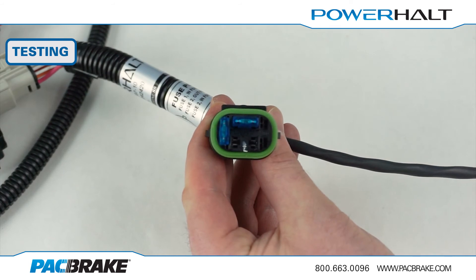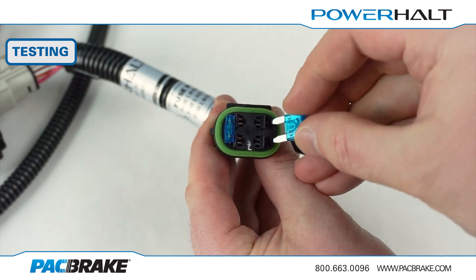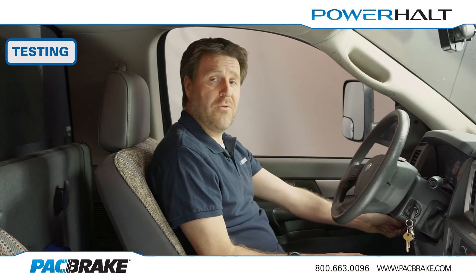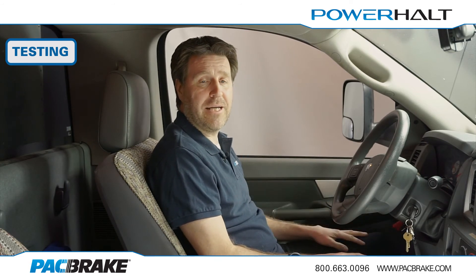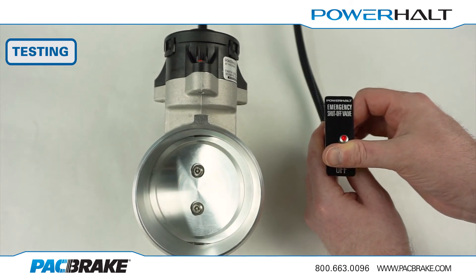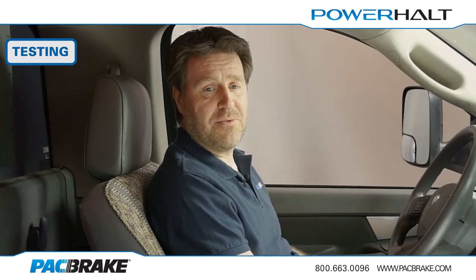To begin testing, ensure the fuse is removed from F1 on the mode selection box. Now with your engine off, push the switch to close the valve and hold the switch for five seconds — one, two, three, four, five — until the indicator light begins flashing rapidly. Now release the switch to reopen the valve. The light will now exhibit a continuous rapid flash interrupted by a single pulse when set for a single trip speed, or a double pulse if a secondary trip speed is active.